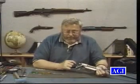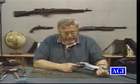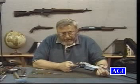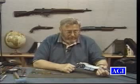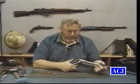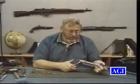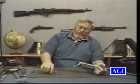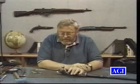So now I have adjusted the amount of creep, I've adjusted the weight, I've adjusted the backlash, and then I had to readjust the safety, and also I've made the cocking piece fall just a trifle faster, so the lock time is improved. The work you do on a trigger is relatively easy to do, as you see, and we've done a nice trigger job on this without working up a sweat.